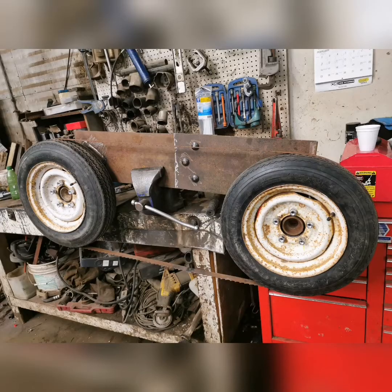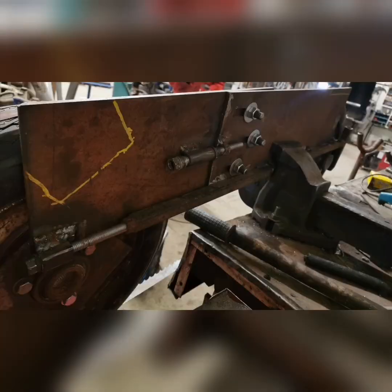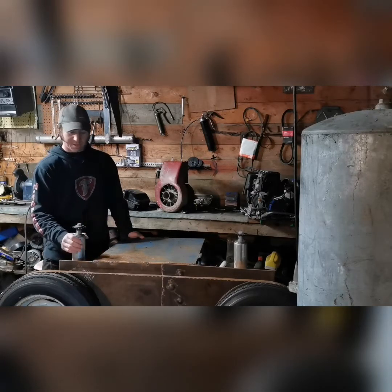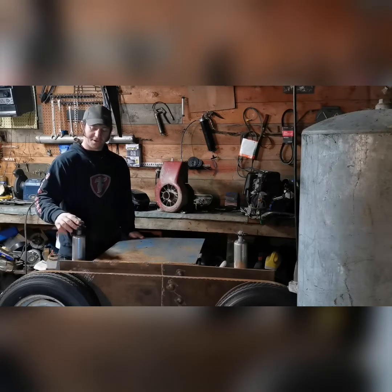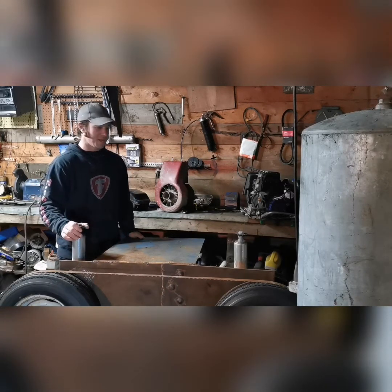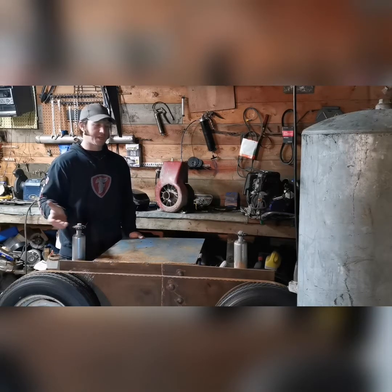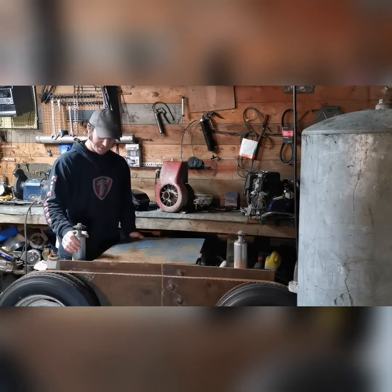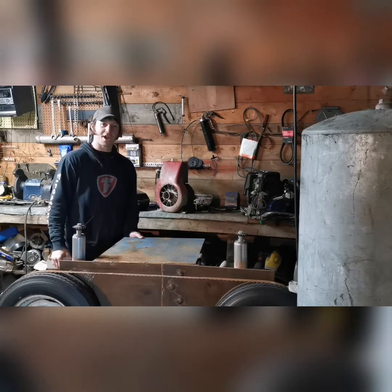Here's the business end of the mill — I'm going to fab up some custom jacks for it. They'll weld onto the back of this thing and on top of the wheel assembly, with adjustments for the tension of the blade. I made these jacks out of exhaust pipe, with some bearings on top, one-inch ready rod, and sprockets off a garage door opener from the dump. I'll run an overdrive to these chains so it works out to about one crank per quarter inch, and I've got like three feet of travel up and down on these things.